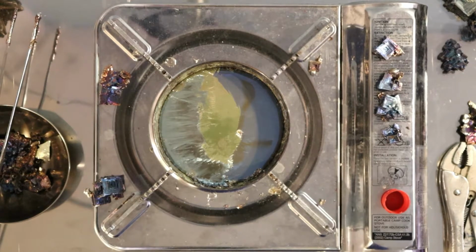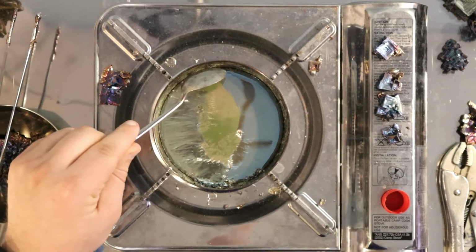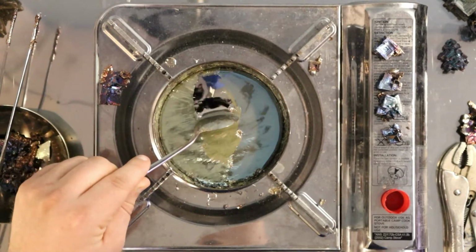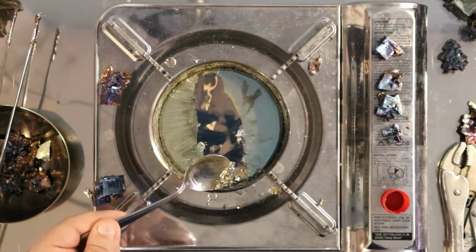But the other thing is that materials have a melting point and a freezing point, or a melting point and a boiling point, the temperatures at which they change phases. But there's also supercooling, and especially in pure materials, say very pure water, you can often supercool them below their freezing point, and then something like a vibration will cause them to start crystallizing. And when they crystallize below their freezing point, they'll often crystallize more rapidly.